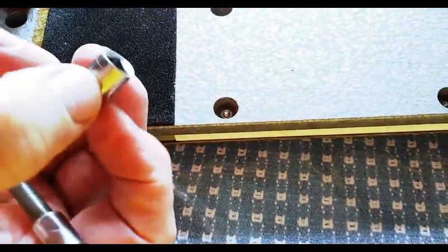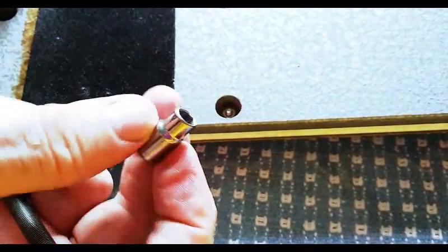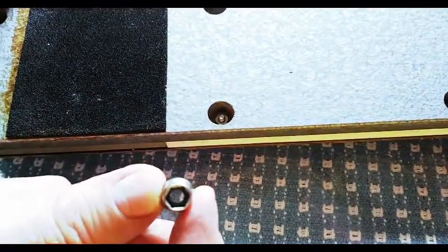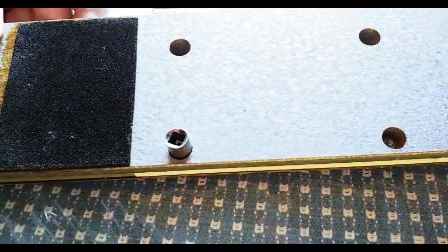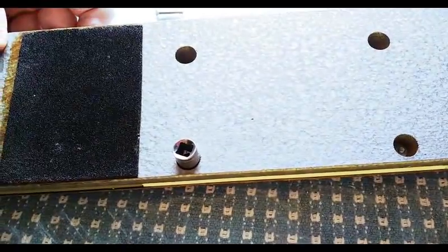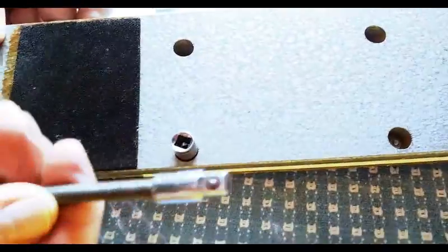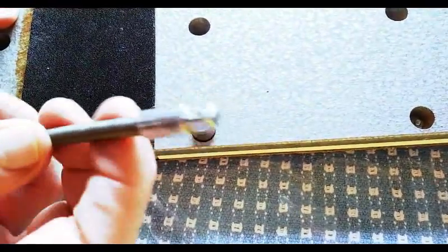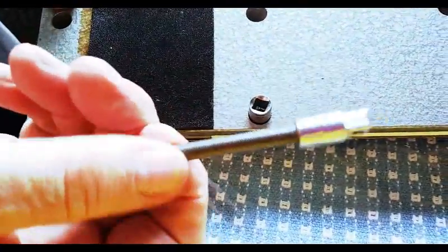You must have a socket with a hole down the middle of it so the shank can slide right inside. If you don't have a full set of mechanic's tools, you can buy a six-millimeter deep socket — get a deep socket because of these holes being farther down inside the machine. This is one of my favorite hand tools: it's actually a flexible extension for a quarter-drive ratchet, and normally the knurling of the flexible shaft is enough to get a good grip.